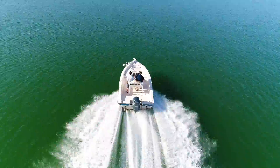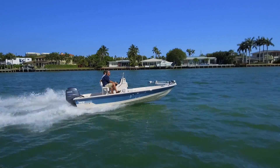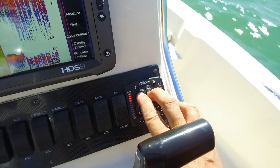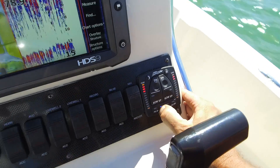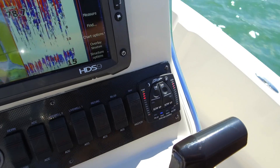The system is now completely set up and oriented. All we have left to do is set what we want for our favorites positions. To set the favorites, we're going to get the boat into the attitude that we want. One main difference between the favorites and the angles we just set is that we have to pay attention to pitch and roll. We can use our trim tabs, engine tilt, or throttle to get the boat into the desired attitude. Then we're going to press and hold either the Fave 1 or the Fave 2 button and the system will take over from there — it'll be in automatic mode.